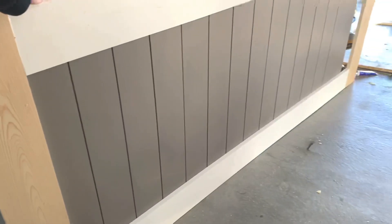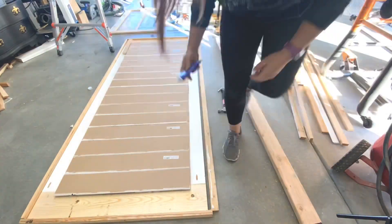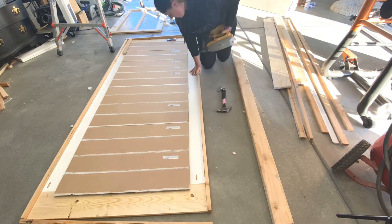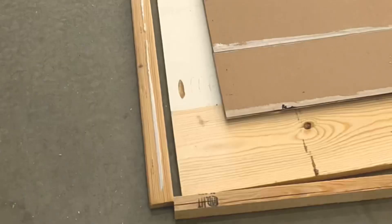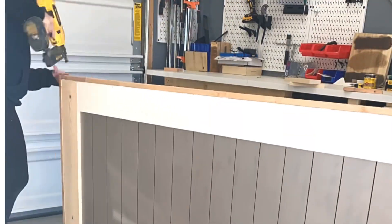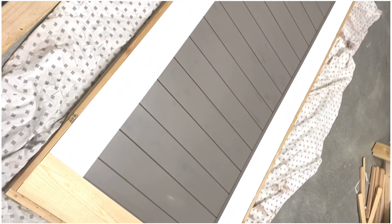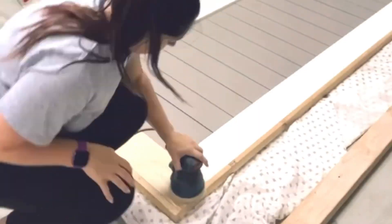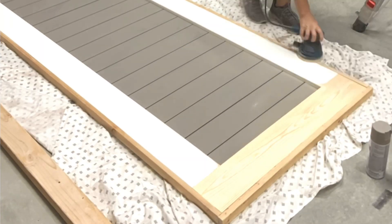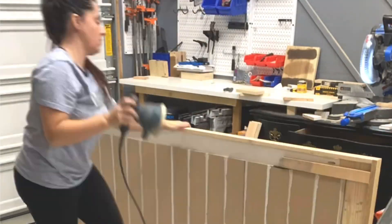As you can see, those middle pieces are painted, and then I used primed boards for the face frame. Now I'm going to go ahead and cut down some 1x2s to the exact length of the door at this point, and then use one-and-a-half inch brad nails to glue those 1x2s into the outside of the door to create a frame. Then I'll cut the 1x2s to the width afterwards. You can use primed boards — that will help a lot. I'm just using scraps I had on hand, but if I were remaking it, I would remake everything with pre-primed pieces.